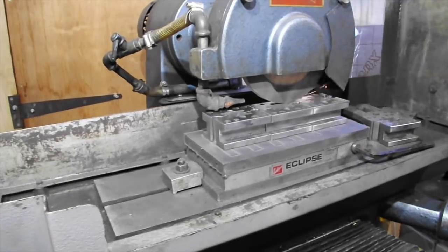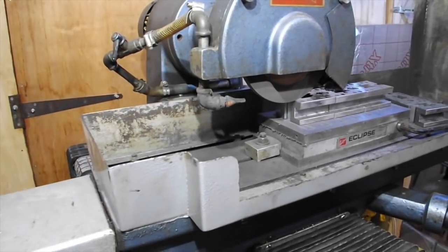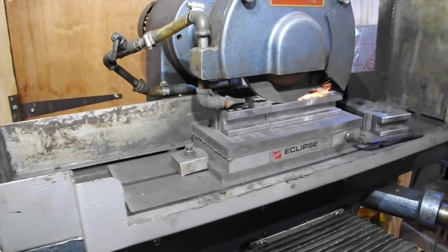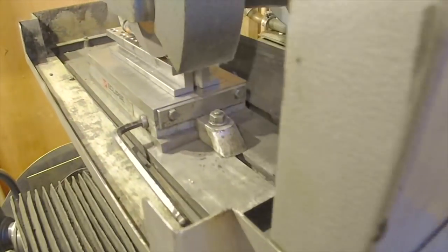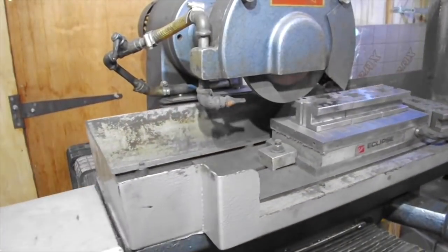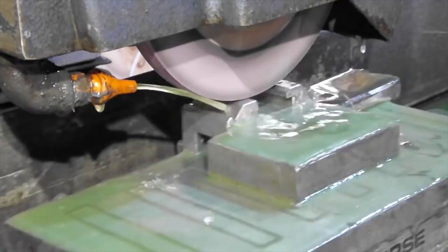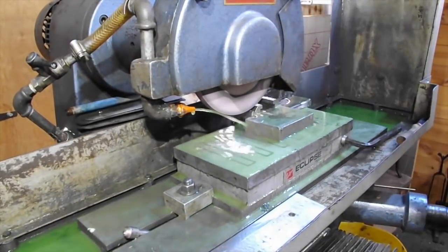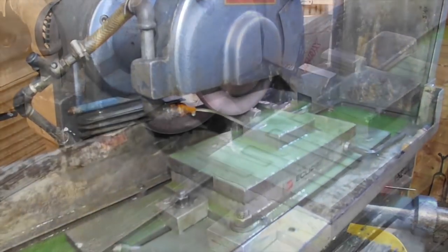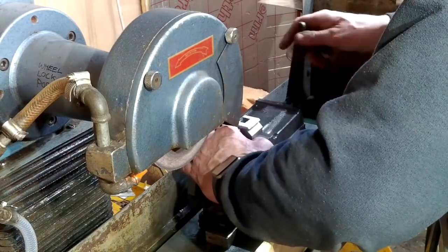Now it's time to tidy up all the faces, starting with the top and bottom. There's such a small surface area holding on to the magnet that I'm using two reasonably sized chunks of steel to hold each tool holder in place while it's being ground. While doing this back face, because they are small faces, I turn the coolant on to prevent burning. For coolant I'm using semi-synthetic grinding coolant, which has to be constantly monitored and aerated when not in use — I'm using a fish tank pump and an airbrick bubbler running 24-7.